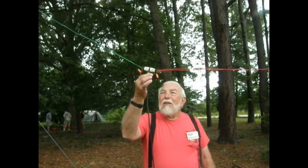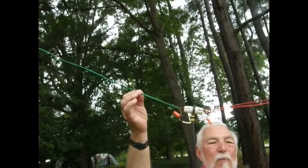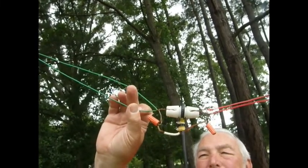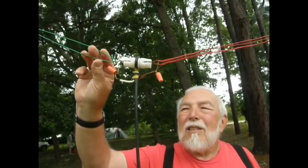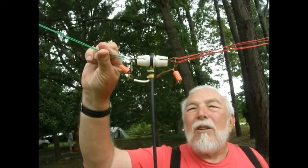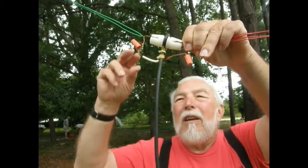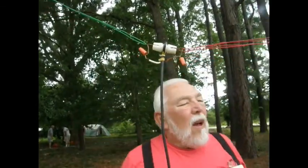I've got multiple conductors on both sides here for demonstration purposes. The wires are just pieces of wire scrounged from various projects — probably hookup wire, about 22 gauge. If you were making a permanent antenna like this, you would want to go heavier. On this side we have two conductors, on the ground side we have four conductors, all connected to the same point on their respective sides. For a longer run, you would want heavier gauge wire, such as 14 or perhaps 12. Some folks prefer solid conductor wire, others prefer stranded wire for flexibility — that's up to the user's choice and operating conditions.